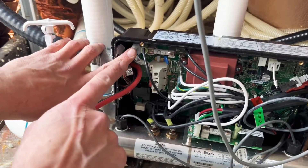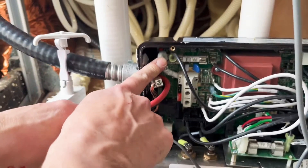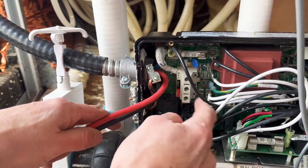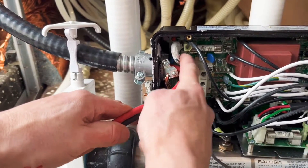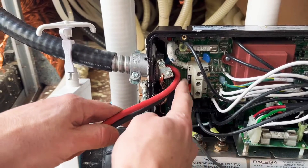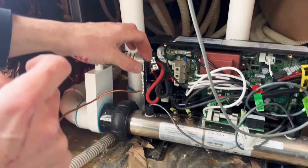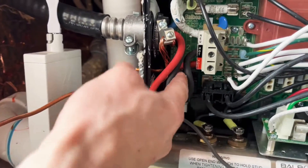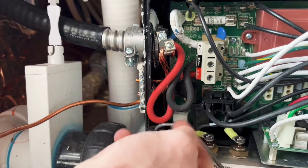I made the neutral connection here off camera because these connections can be kind of finicky and hard to get to — I just had to put a pair of pliers on there and work it into its spot. You tighten this lug right here and then do a tug test to make sure it's not going to come back out. You can see the connections made — I did black to black and red to red just to make it make sense — and you can tug test them.